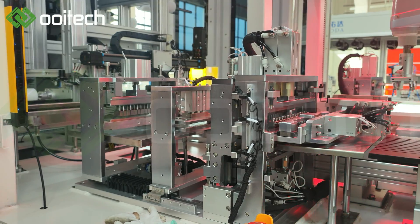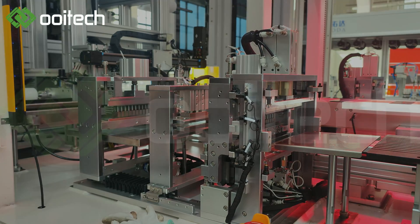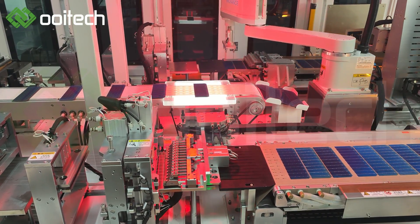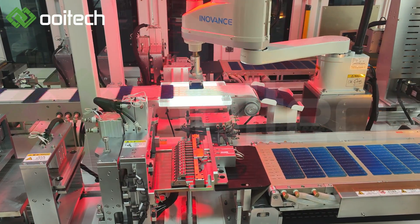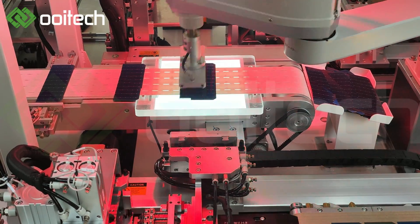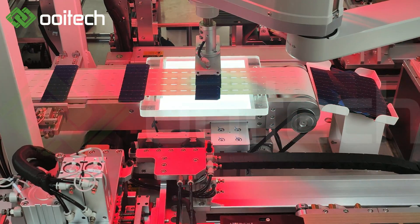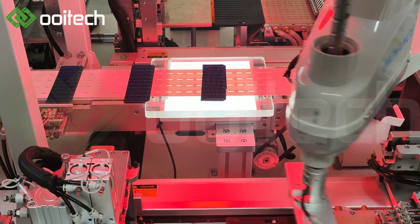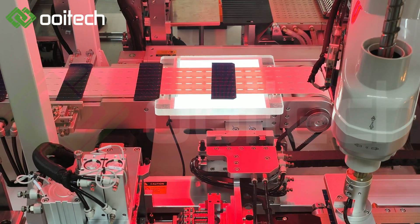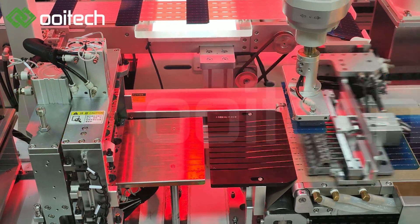Equipment ensures advanced, qualified soldering effect, which approves soldering pull testing higher than 1 Newton per millimeter on cell surface. 0.6x0.25mm ribbon, 180-degree pulling angle, and accepts HJT cell.